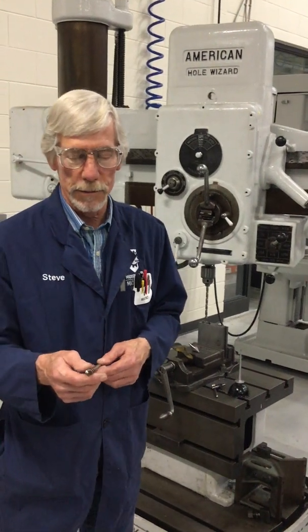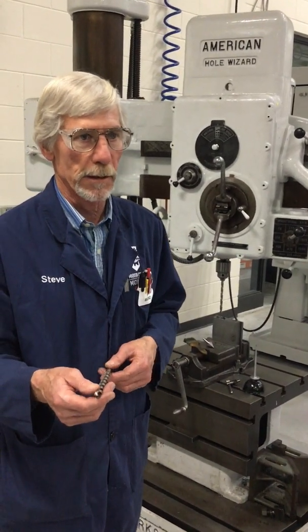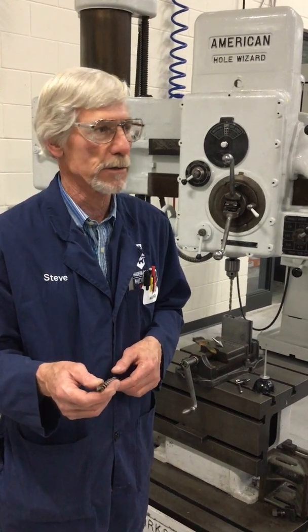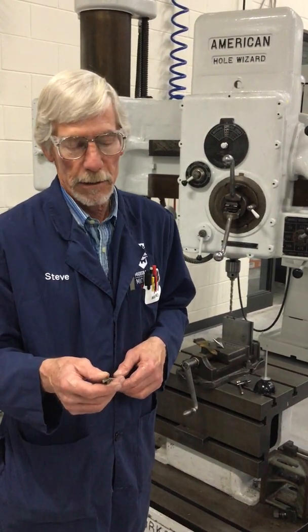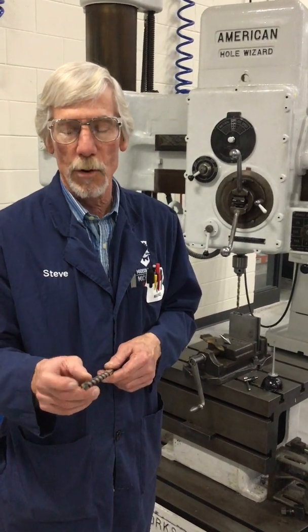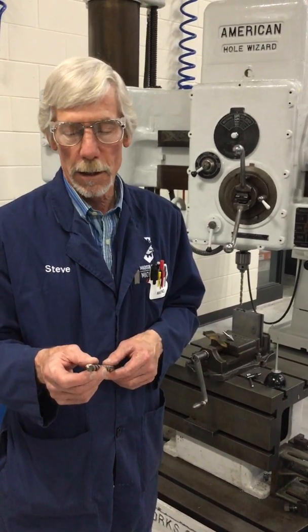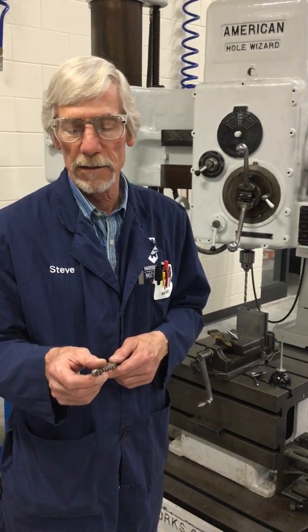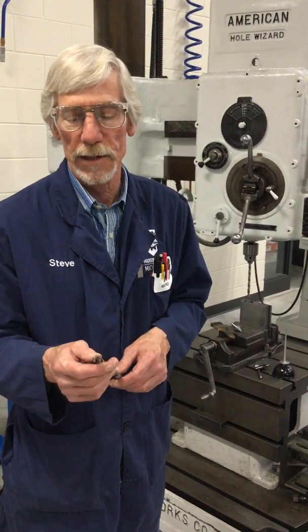Of drills I'm using, I kind of downplayed using the standard jobber's drill. That's just the standard 118-degree chisel point, and I really don't like those. They're good enough for drilling wood. But I always take them over to our drill sharpener, and I always put a multifaceted point on them, so I make them more center cutting.